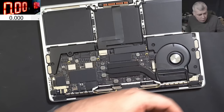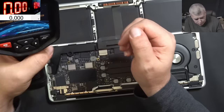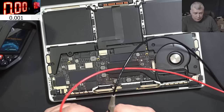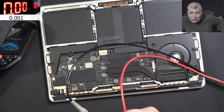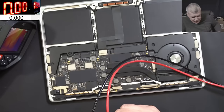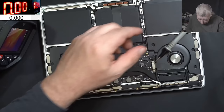How can we find where the problem is? Very simple - let me grab the thermal camera. We can come with the current and see what is getting hot - we are pushing current into the short. Can we do it without the thermal camera? Yes, you can, but you have to use more current. Using more current is tricky, because you don't know what is shorted. What if it's a MOSFET shorted and you actually push current into the CPU or chipset? It's kind of tricky. But anyway, this short - from what I see - the voltage gets dropped to 0. The short resistance is very low, so it's very possible to be a capacitor. We need a ground. Coming with current here, we have to raise the current because we have no voltage.